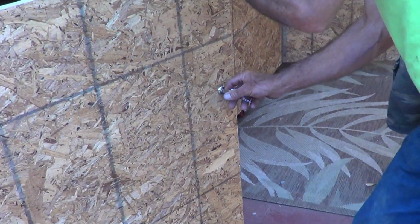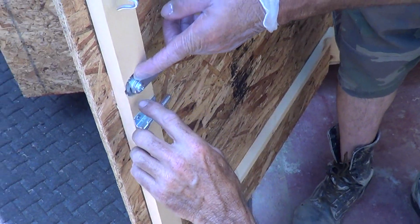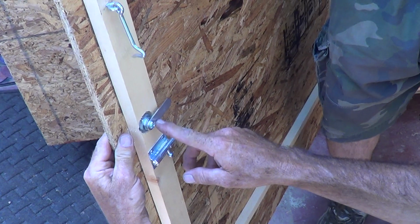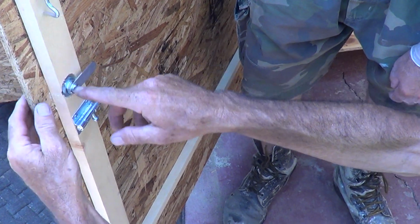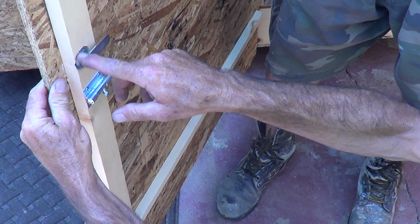But you realize that that is two holes bored with a Forstner bit. Two holes, with a Forstner bit. One through this, because this lock is designed for an inch-thick door, and this is an inch and almost 3/16, or an inch and a quarter. So it's counterbored with this hole, and then bored with the 1-inch hole after you counterbore with this larger one.